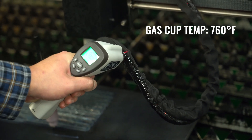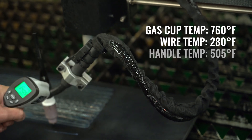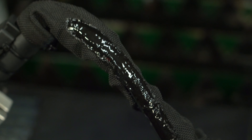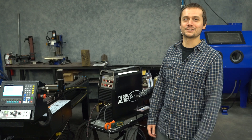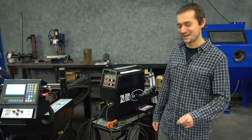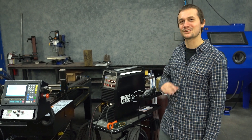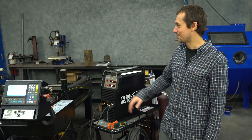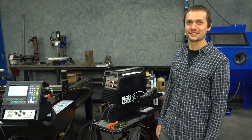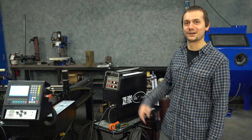Even back here: 230, 280 — over 500 degrees. You're not holding that in your hand. So we're doing some torture testing here today. We just ran this TIG 200 AC-DC for 13 minutes at 220 amps straight — no stops, no pauses. We got it hooked up to the table to eliminate human error, and this thing took it like a champ. The weak point was the air-cooled torch.